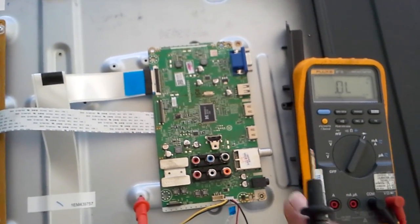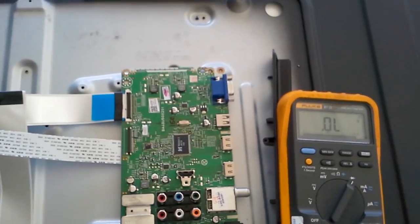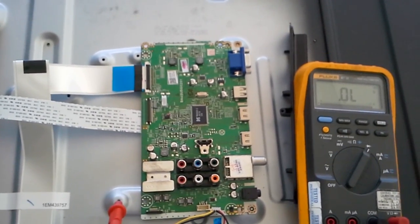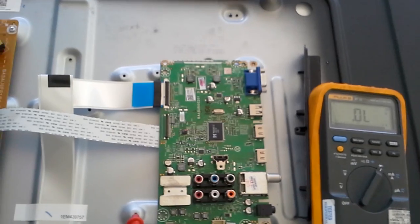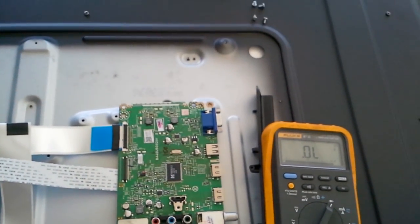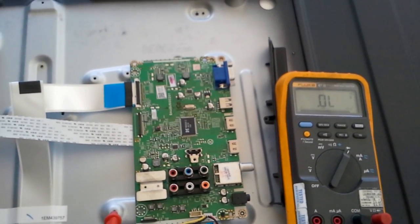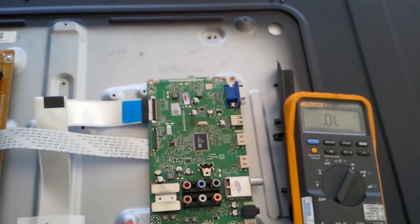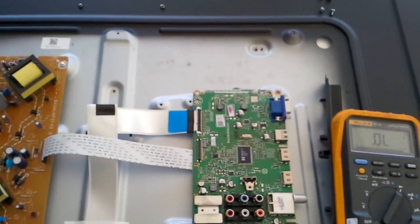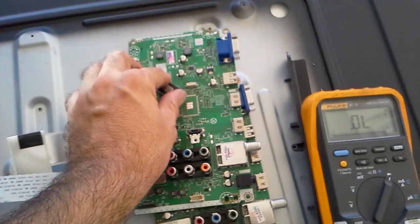Another thing we've seen on that board, and that's true for many boards of those generations, is of course the EEPROM going bad. If the EEPROM goes bad, the typical failure for the board is just a totally dead TV. This is not so common for now, but I wouldn't be surprised if they start failing over time because the protection for those is not very well done. It's easy to mess up the information in there. It's just that they haven't spent a lot of time making sure that the memory doesn't get overwritten randomly and badly and screwed up.